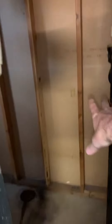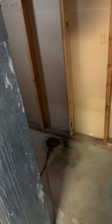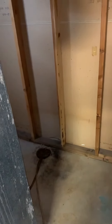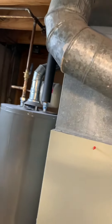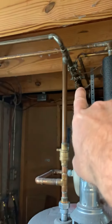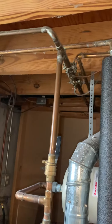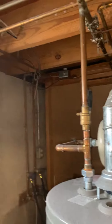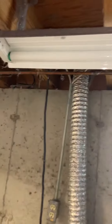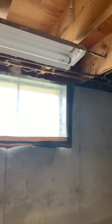For the humidifier, we may want to look at putting it on the face or at least on the back, just so there's still some room to get through here. Got measurements on the return and supply. We have a few piercing valves here, and we'll obviously want to get a ball valve in there for the new humidifier.